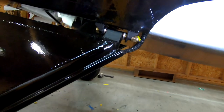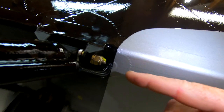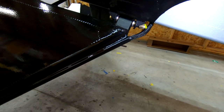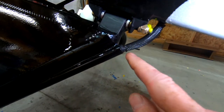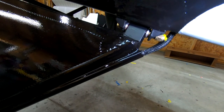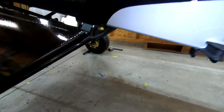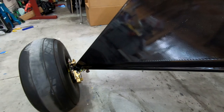Where the brake lines come out on the underside, there's a grommet and that's where it comes out. There's the little plastic piece done inside there and I put a little bit of mesh protection on it. In my earlier videos I talked about this tube that I glued onto my landing gear — covered with the carbon fiber tube, a little grommet on the inside. So as that brake line tube goes in there and it's free to move around, it reduces the amount of chafing and protects that up. Then obviously I've been cleaning all these up, and it exits right there. I think that turned out pretty cool — better than what I expected.